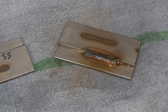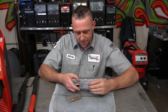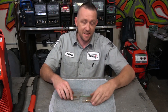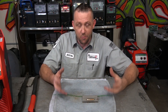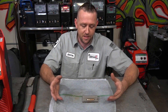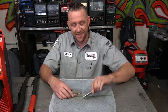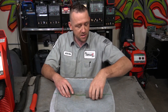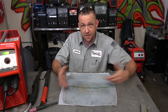It's pretty wild — those are some pretty interesting results. I've always wanted to do this and find a way to show it, and finally I have. So at the end of the day, the answer is yes: you absolutely can weld stainless steel with mild steel filler rod like ER70S-2 or S-6. The only problem is, obviously, it's going to rust. This episode is a little short, so we're going to throw in some bonus material about the impregnation of foreign metals into your stainless steel.